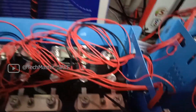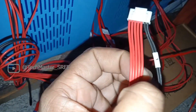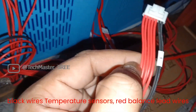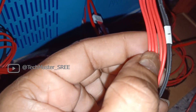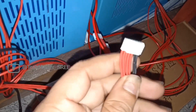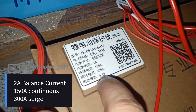You can see the BMS connection diagram on the screen. Always make sure all nuts and bolts are properly tightened to avoid loose contacts. The black wires in the balance lead are temperature sensors — there will be one temperature sensor in one set of balance lead, and there are four sets total. The number on the temperature sensor helps you identify the balance lead number. These red balance lead wires can carry 2 ampere current, since this BMS has 2 ampere active balancing. Many BMS units are missing that — my videos are for educational purposes only; electricity is dangerous, so be smart and use common sense.